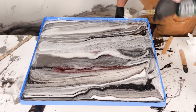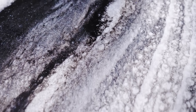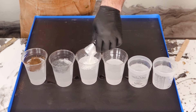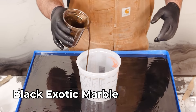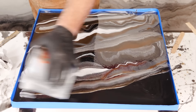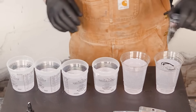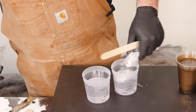This is an exotic dark marble using dark black mica and black dye to create a very pretty natural piece where you pour it right out of that bucket. Mix the epoxy, add your colors, pour those into a bucket and pour them right over your countertop. We're using a little extra material, so that's why we put a tape dam around the perimeter of the project — that holds all that epoxy in place until it thickens up.